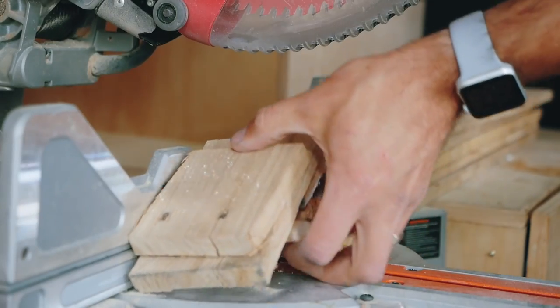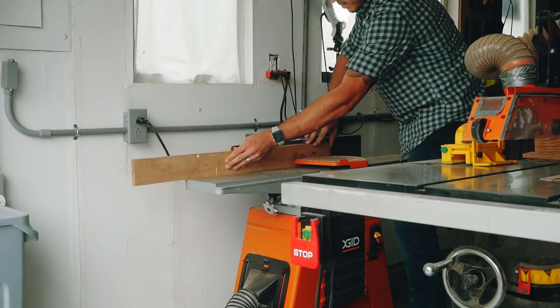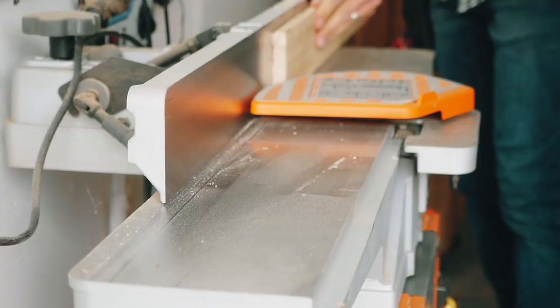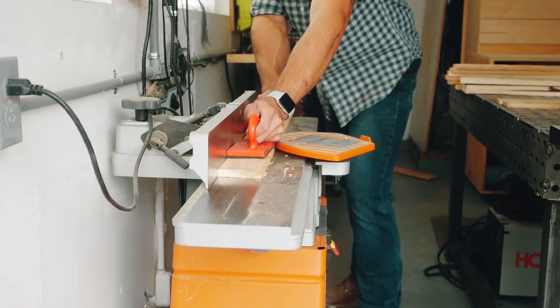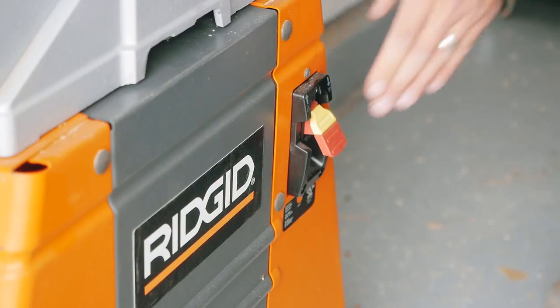To get the remainder of broken nails out, I flip it over, take a hammer to bust out the nail we didn't cut, then use a center punch to hit out and pry out the cut nail as well. To save time on the ends, we just use a chop saw or miter saw and cut the ends off. For this project we're going to preserve as much of the pallet wood aging as we can, while also jointing one edge and one flat surface — not taking out more than about one or two sixteenths of an inch.